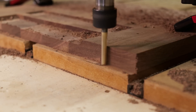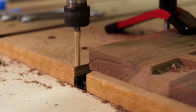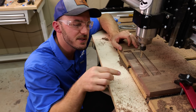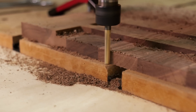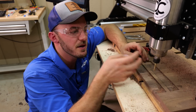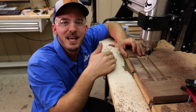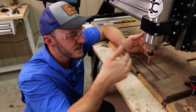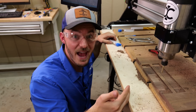Because the rougher is doing most of the work and lasts a lot longer due to the serrations, the finisher — which gets dull quicker just like a kitchen knife — doesn't have to do much cutting; it's really just scratching away those serrations. In this way you're using a bit that lasts twice to three times as long, and your sanding time goes way down because you always have really nice clean edges without frizzies and tear-out. The finisher came by and did a really nice job of cleaning everything up and taking off those serrations.